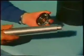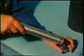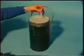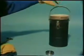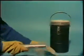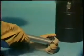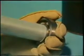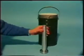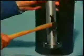Instead of heating something and shrinking it on, we can do the opposite. This ball race will not fit onto the shaft — each has been accurately machined, but they don't quite fit each other. We place the shaft in liquid nitrogen. This will cool the shaft to minus 196 degrees C and the metal will contract. After 10 minutes or so, we take it out and now it will fit into the ball race. We leave it to warm up again. The shaft has now expanded to its former size, and there's no way we could get the ball race off.